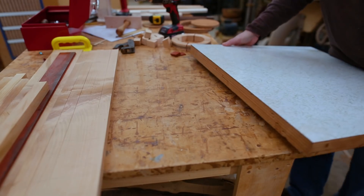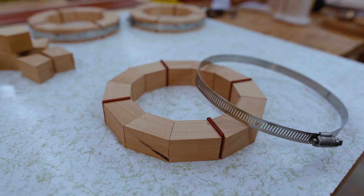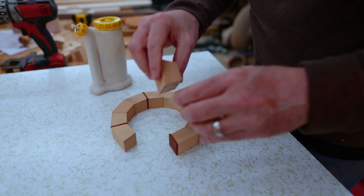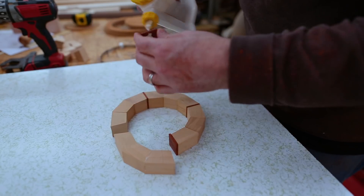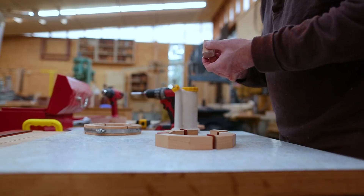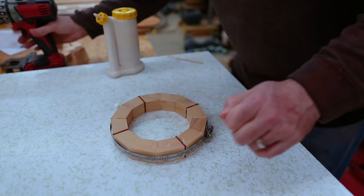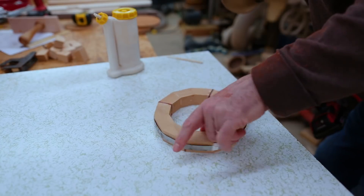I can insert four of those dark strips into each ring to divide the rings into four sections, which will become the seam running down the length of the football. I can glue up the rings — it's just a matter of getting glue into all the seams. As I did more and more rings, I started gluing the center segment in first on the four different quadrants, then putting glue on each side of the thin seam piece and gluing the four quadrants together. That seemed to work pretty well as a gluing process.